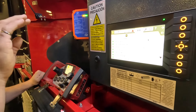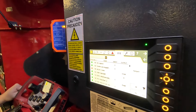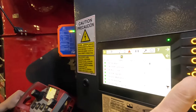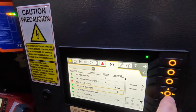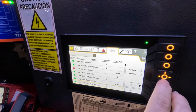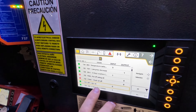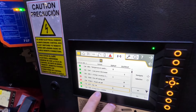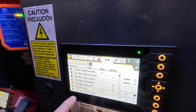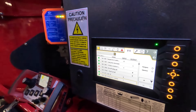This is your input and output screen. If you want to know what everything coming out of and going back into the pump computer is doing, this is your diagnostics screen — you can scroll through all the different items. It will tell you open circuit faults. For example, this proximity switch is showing e-stop channel one at 24 volts showing a one, meaning it's active.